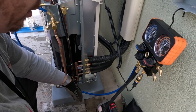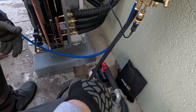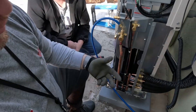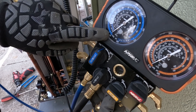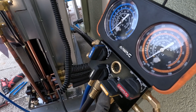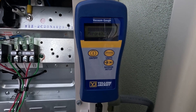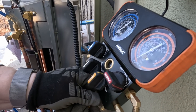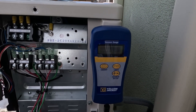Get everything going and turn your pump on. You're going to want to open your evacuation port, then open up your suction and see how it starts sucking down. We're going to hook up a vacuum gauge — this is what you want to use to verify your microns. Right here is your service port. You hook it up there, open it up, and you'll slowly see that going down once the evacuation process starts happening.